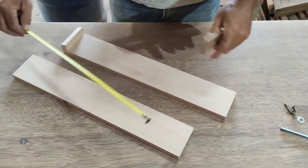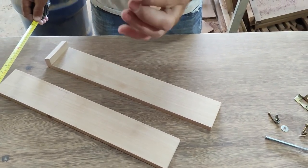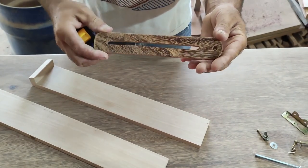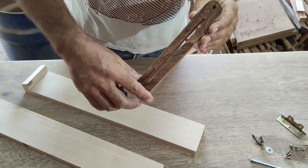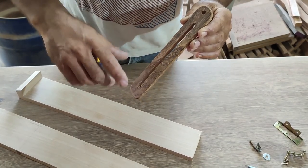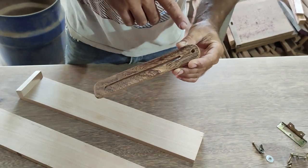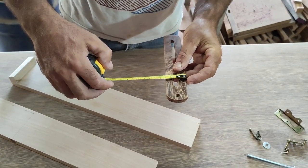I will explain about the size — it is not a standard size, you will make it the way you need. Another piece: I used a thin strip of sucupira wood with a slot. That is the adjustment slot, 4 cm x 22 cm in this format. This slot can be made with a router. The tip to make it is to first cut this strip wide — I did it at 12 cm — then I clamped the strip with a clamp, made the two holes in the size I needed, and used a router with a bit to open the slot. So: 4 cm x 22 cm.